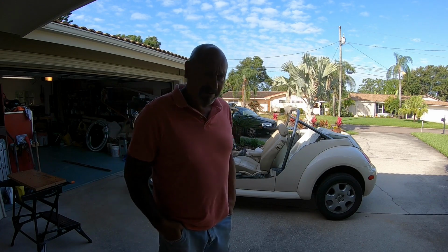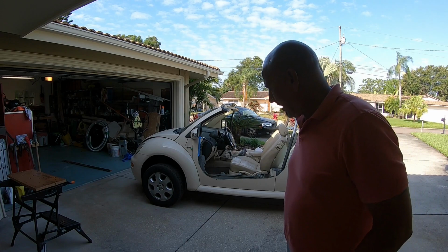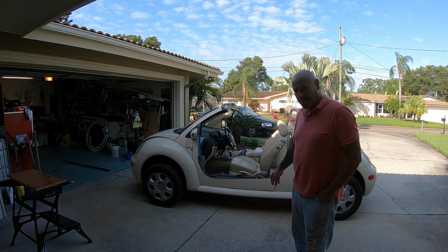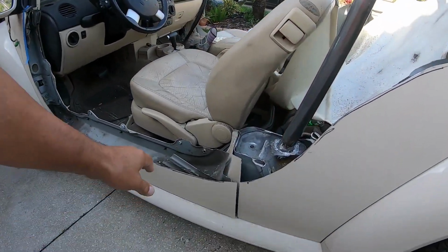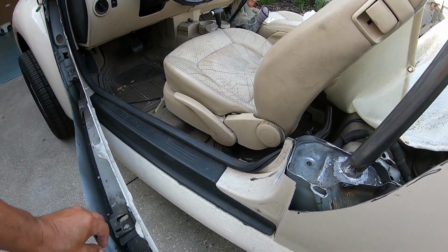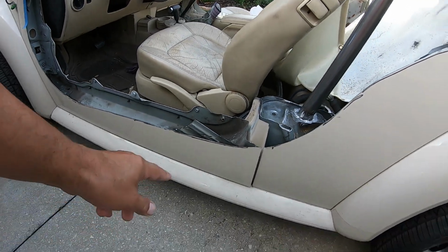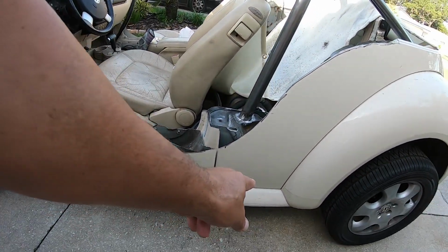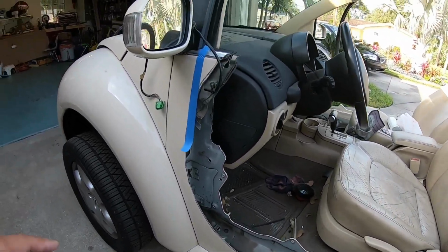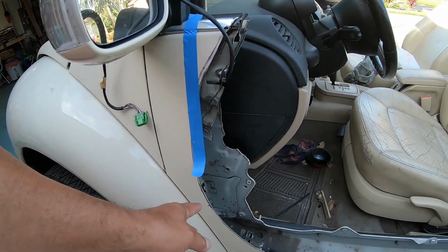We're getting there. Today I am going to start working on the bodywork. Try to grind and weld in the seams. Okay, so I'm going to secure these doors. Obviously get rid of this rubber padding, and grind the bottom of the doors, grind the top of the rocker panels, which are metal. I'm going to be doing some more trimming over here, kind of do some final shaping.